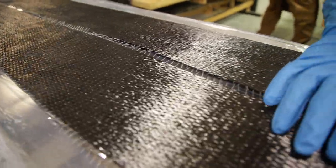That's going to help reduce weight everywhere and take a little bit of resin out of the ski. We're going to do a separate layup on a different bench to make sure we take any excess resin out of the ski, because weight is so critical — two ounces matter between these. We're going to use a little bit lighter weight core and make sure we have the lightest aspen in-house. We're taking the core profile down a little bit, and we have a smaller binding mat — a form-fitting binding mat made of epoxy underneath the binding area to reinforce everything. At that point we're going to be right on. We're ready to go into this layup.